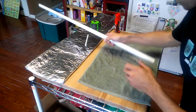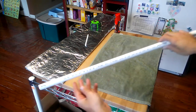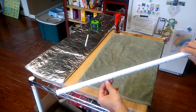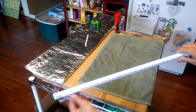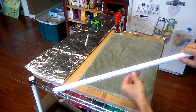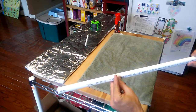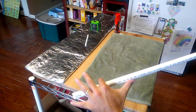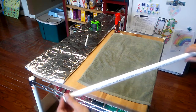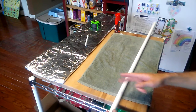Start off with the blade. I'm taking half-inch Schedule 40 PVC — this is just the scrap I have. I marked seven and three-quarter inches inward, then I marked five and a half inches. From the seven and three-quarters, I marked five and a half inches again. What we're going to do is cut between here and there at an even angle, so these are going to be two equally sized pieces, seven and three-quarter inches long.